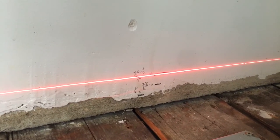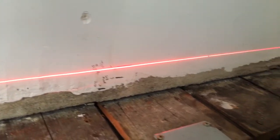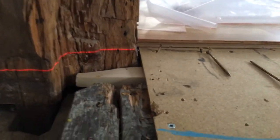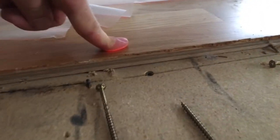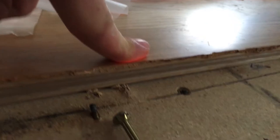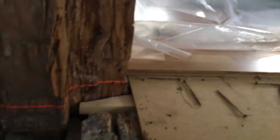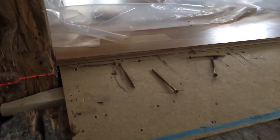All the weight is transferred directly onto the joist, which is transferred directly to the center column or center joist and down into the columns, so you won't feel anything — it won't bounce or do anything weird. Here is how you calculate the height of the top of the floor. All I did is go to where I have an existing floor on this side, and you can see the line right there — it's pretty darn close. Here's my favorite thing: ET phone home. As you put your finger on the bottom, you can see the bottom of my fingers lit up, which means it's right there on that line. So using those lines on the wall, we're gonna level everything else out in the room.